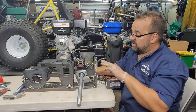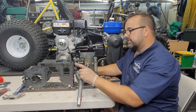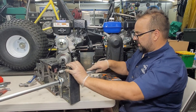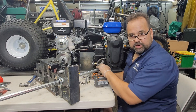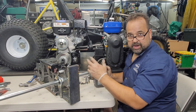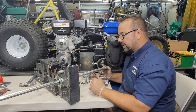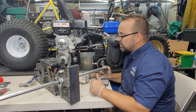I must caution you: there are a couple of iterations of this caliper — one is kind of a left side, one is kind of a right side. I've only got a solution right now for left-side mounting. Power packs use a jack shaft, so the sprocket will be on the opposite side, and that will slide on nice and easy. The advantage of having your axle generally located is that once you get everything square, you can put a couple of bearing carriers on the ends of the axle and build your frame out to those bearing carriers. This will locate all your key components in your powertrain assembly.